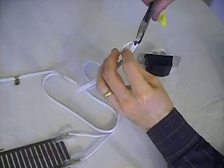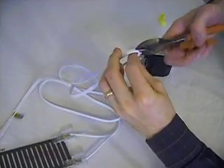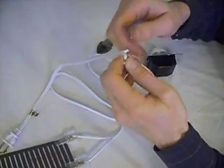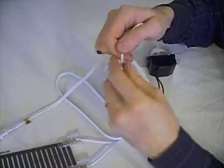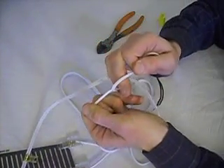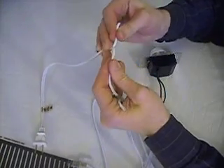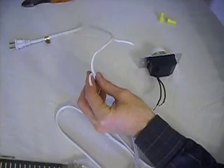I've snipped through one wire. Now I will take my wire cutters and very carefully snip a little piece of that plastic here and a little piece of this plastic here, because what you want to do is get it so that you can pull these wires apart — give yourself a few inches, enough that you can work, just like that. Pull the second one apart just like that. Make sure that the second wire here has no metal exposed — that's what you want.